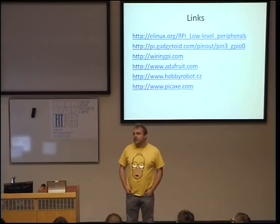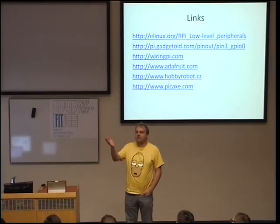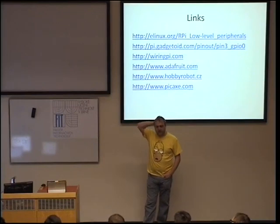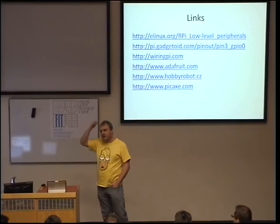Yes, it's accessible. You can use it. It's from source code. Again, if you use the C library, there is a command to use hardware PWM. Same for Python. I think there is no library for it. I'm not sure about the software PWM for Python because it's not quick enough.